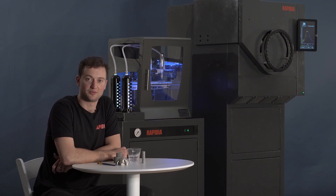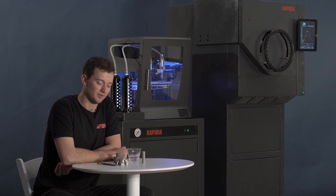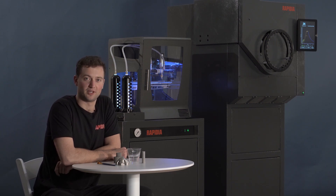The objects printed on our 3D printing system are water-soluble when they come off the printer. This means that multiple objects can be bonded together using some water before they go into the sintering furnace.